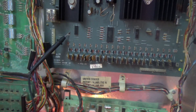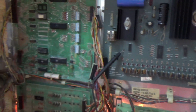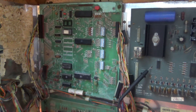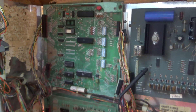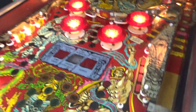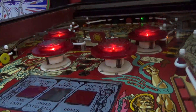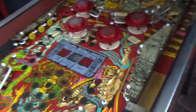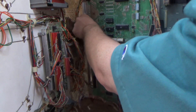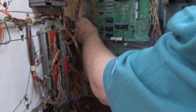The voltage regulation sections on that board are just fine. We think the solenoid driver section is fine, but we don't know for sure. So the first thing we're going to do is plug in this old MPU that's all eaten up and just see if it boots or anything. We don't think it will, but it might. This is basically what other people are going to run into if they try an old machine that's been sitting around — you can see that alkaline has eaten up the bottom four inches of that board. It's one of the worst ones we've seen in a while.